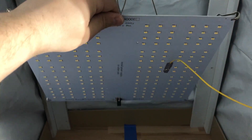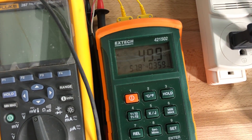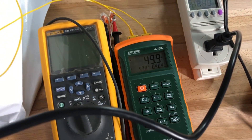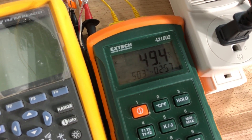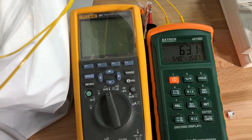I also tested the board and driver temperature for each of these kits after running for an hour, using a pair of thermocouples. The HLG-100 board ran at about 50 degrees Celsius, and the top of the driver case hit about 58 degrees Celsius. The HLG-65 ran cooler with the board hitting about 49 degrees and the driver 50 degrees, and the hottest was the 135-watt kit, on which the board measured 63 degrees and the driver measured 54 degrees.